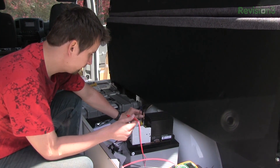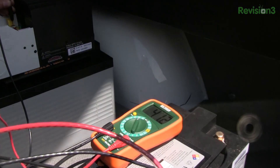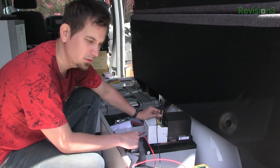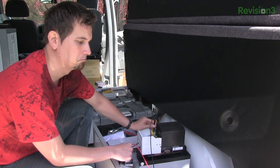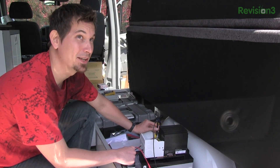Out of the solar panels, I'm getting 41.2 volts right now. They're both rated at 22 volts, so that's a maximum of 44 volts. I'm only losing almost 3 volts through cable loss — that's pretty efficient.